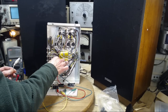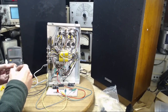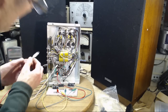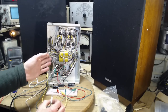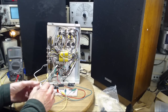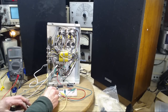There's high voltage on that. That's a terminal. I don't think I should stick my fingers in there. Not operating. Got all this capacitance here. The discharge. Okay, a little bit safer. So this is the power on. I wouldn't imagine the condition of the individual sections of the capacitor here to be any different. If one's worn out, they're all worn out. If one is good, they're all good. Let's find out. Okay, first to charge this capacitor through the resistor. Okay, now we're going to add it in. No difference whatsoever.